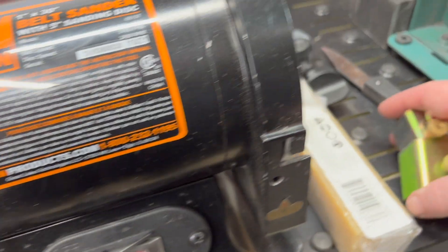At 0.05 I'm not really that concerned about the hundredths as I would be the tenths. To set your angle guide properly, you want to go up against the platen where the belt's running straight - that should be your zero. You hold in the zero button for a couple seconds, it'll start to flash, and then it's going to re-zero. It's still showing 0.05, so it needs to come up just a tiny bit to be perfectly at zero.